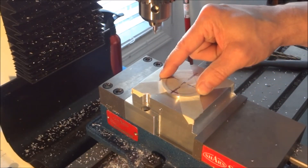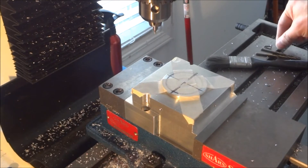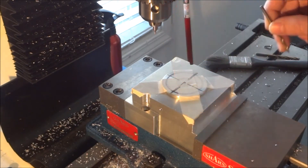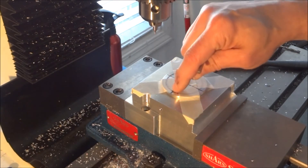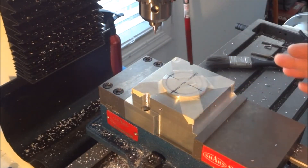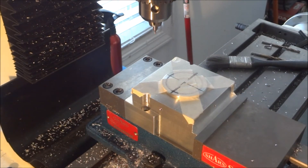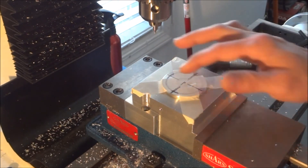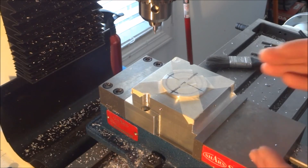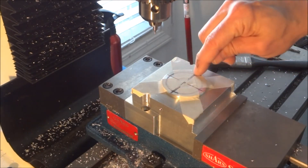I've got the bearing cover taped into the X-axis bearing block, just taped in position, because I'm going to center drill, drill the hole for the threads, then come back with a bigger bit and drill through the cover. That way I get all the holes lined up - it's just taped in place and shouldn't move. None of this is real critical as long as the cover fits this particular block. If I were doing this on a CNC machine I wouldn't have to worry about alignment, but with manual machining you just want to make sure everything lines up.